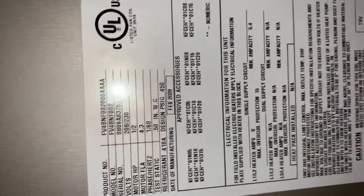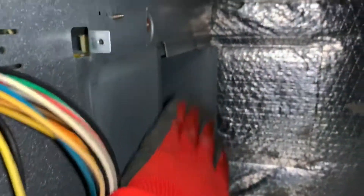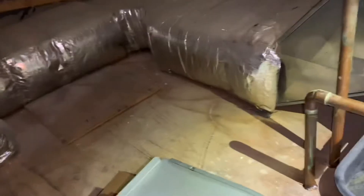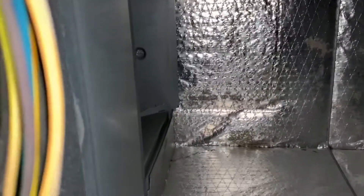I've already got the old motor removed. You can see where the motor sits right here. There are two grooves — one up top and one on the bottom of the housing. The housing just slides right in like that, top groove and bottom groove. Then this front piece goes in and basically locks it into place. Two 5/16 screws hold it on this side.